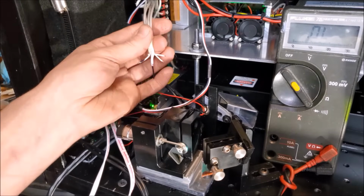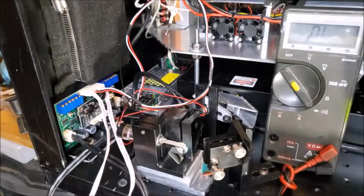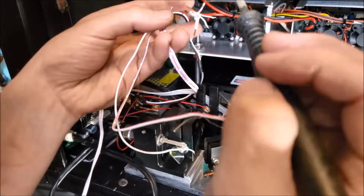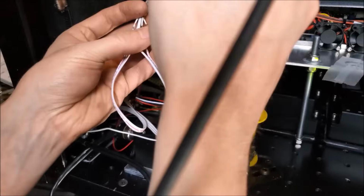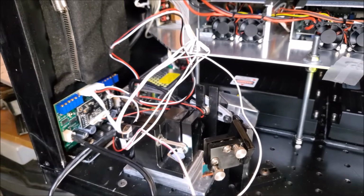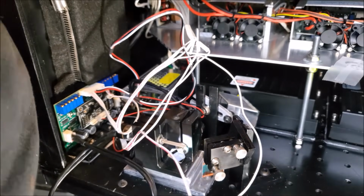So yeah, as soon as I hook this up, essentially I should be able to do laser beaming moving things. So let's go ahead and do that. I'm going to shut down the unit. And we'll get some soldering done. You can look up the ILDA pinout too. It's easy to find online. If you ever need to connect your own galvo set, it's actually really simple to do for the most part. That looks mostly out of the way. Mostly. Okay. So I'm going to turn on the laptop and get the laser running. So give me a minute and we'll come right back.